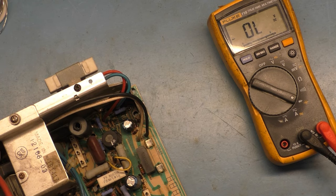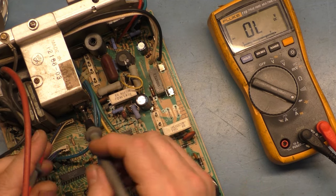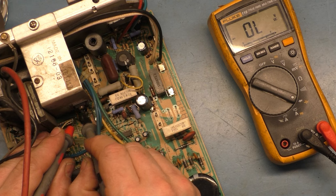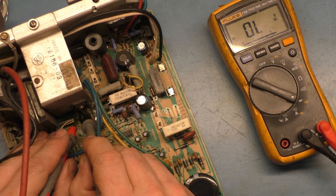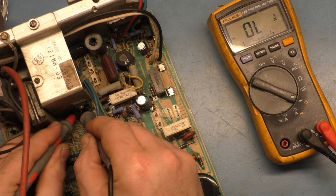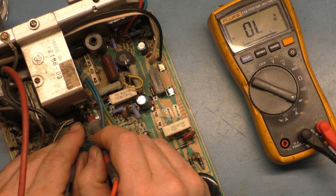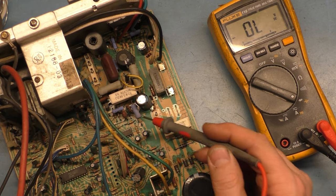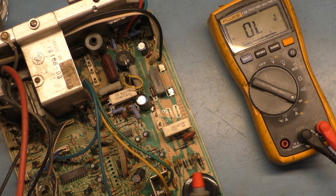We can read our HOT on the top side. Negative lead goes on the middle pin. And each leg should be about 0.45 as voltage drop. So test the HOT. And it's shorted, as suspected. Yep, given our low reading on R101, I knew that something was shorted, and sure enough, HOT.